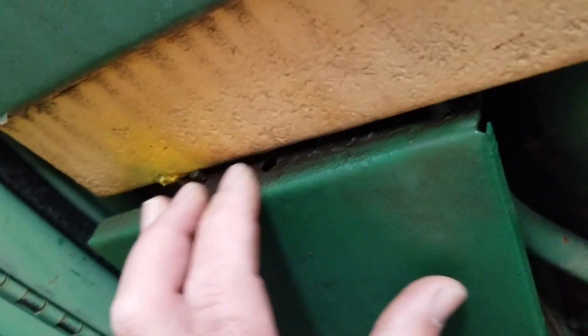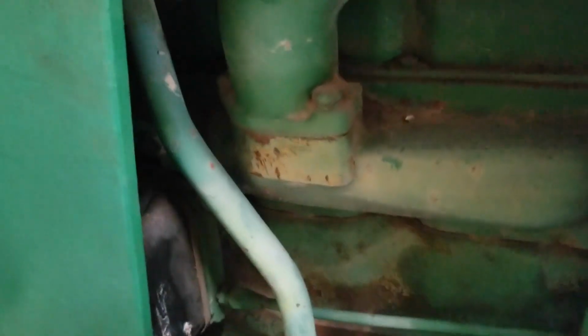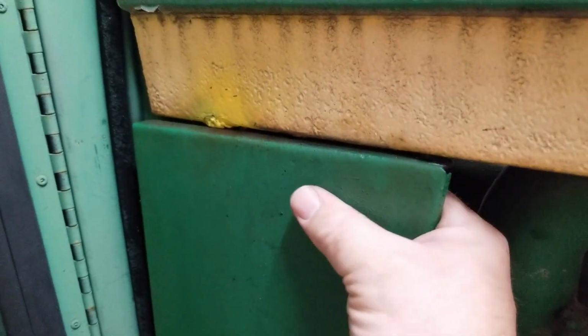So for the side cowl, see, we got it lined up over the roll pins. That little plunger lets it push against you. So you push against that, and then you finagle it around until you find the holes that these top pins go in. And it's not as hard as I'm making it look. If you can put two hands on it, oh, that's really nice. Oh, there we go. I think we're in. Yep, we're in. So that little plunger is pushing up on the whole thing and pushing the two pins up into the holes in the hood.